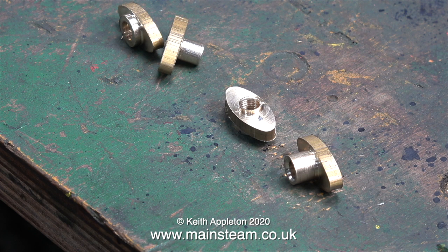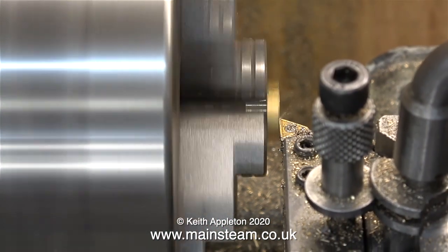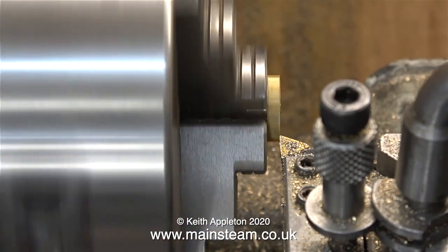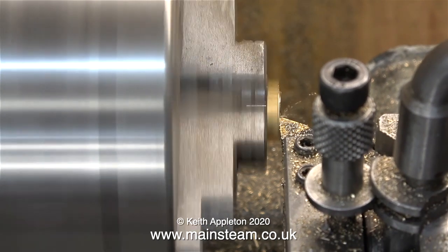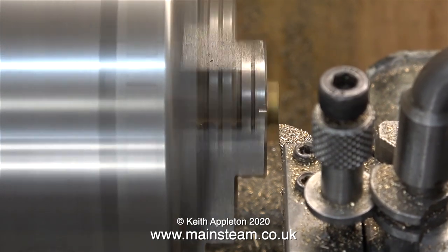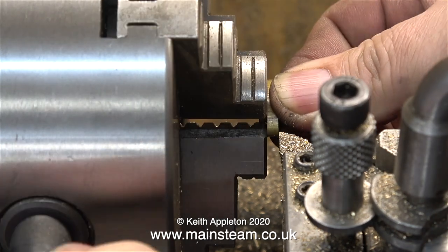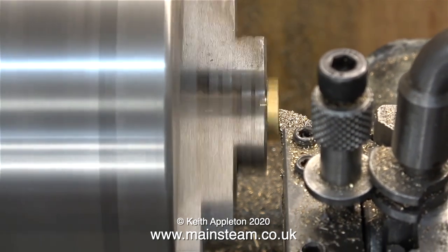Here are the parts awaiting being trued up in the three jaw chuck. The flange thickness of the fitting at the top of this picture is about the right thickness. The three jaw chuck is now refitted to the lathe and I'm machining the thinnest flange first — the lathe saddle is locked in place so it can't move. All I now have to do is put each fitting into the three jaw chuck in turn and take a nice smooth facing cut across the front. I did this on the gland covers first, followed by the two identical steam flanges. You have to be a bit more careful when you machine these because there isn't as much depth to go into the chuck jaws. When I parted off the flanges they were quite close to each other so I'm only having to take very fine cuts.